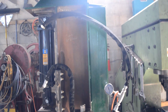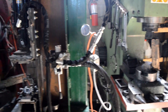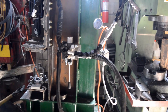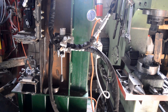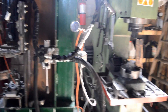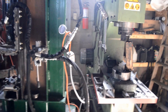In hindsight, one other thing I could do with this press is install a second cylinder on the other side to do other operations on the same heat. It would require a better control valve capable of running two cylinders, a second cylinder on the other side, and of course welding up the additional ram assembly. So it's a little bit more work, but if you're doing that kind of stuff it would really be worth it — just something to consider.